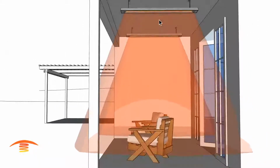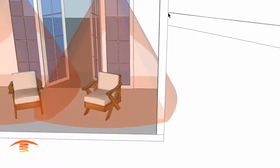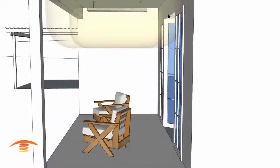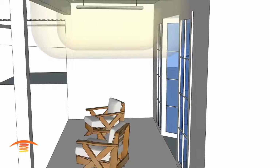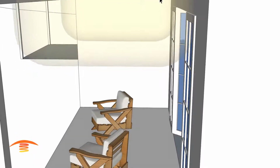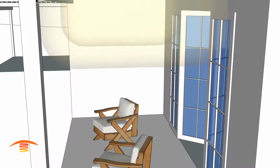These are 4,000 watt units, so single element. You can see that they cover the area quite well. Two of these units would. But the problem is that we do have a clearance issue, and this yellow globe here is the clearance for the unit. You can see that in this configuration, we're penetrating this wall. This is 18 inches of clearance from the face of the unit downwards and over, and also 36 inches down below. And right here, it penetrates the beam.